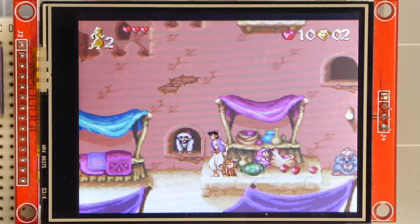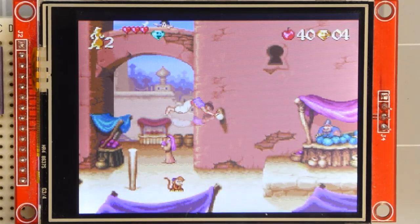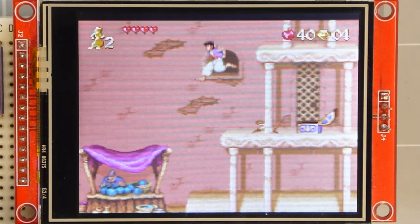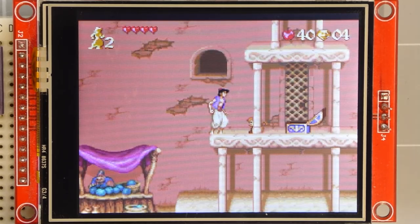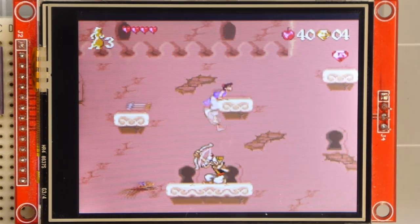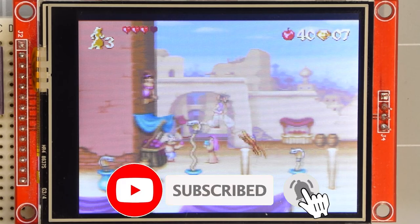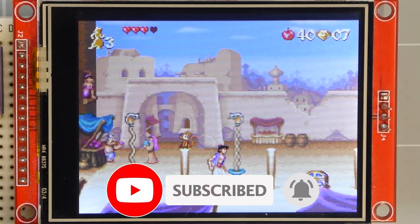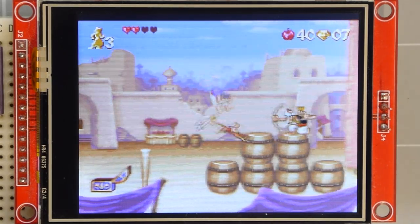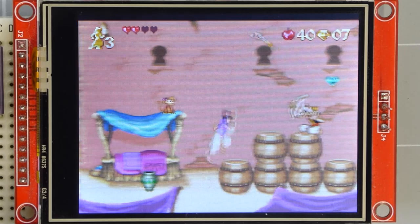So that's how to set up a high frame rate LCD screen on a Raspberry Pi Zero powered RetroPie system. We've seen that we can use a very cheap generic LCD panel working over the serial SPI channel and still get well above 30 frames per second with smooth clear animation for our games. This is really the first step in putting together a portable retro games console. If you've enjoyed this, subscribe to my channel and click the notification bell. Check out my main website for the circuit diagrams and code used in this video.